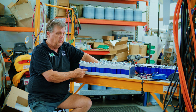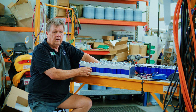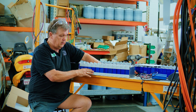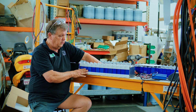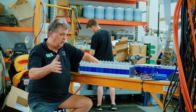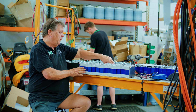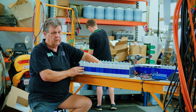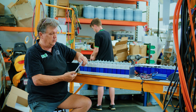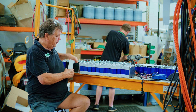If you wanted to run some air cooling, you could get quite fancy — running a trigger from your BMS to activate the air conditioner, putting in a valve, and pumping cold air through depending on whatever relays you activate. Or you could just run a fan at one end of the battery box to get some airflow between the cells. Usually you build a battery pack big enough that it doesn't need cooling, unless you're doing DC fast charging, which is becoming more common on home builds and conversions.